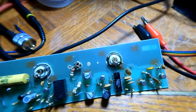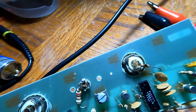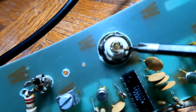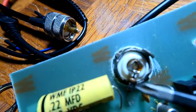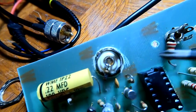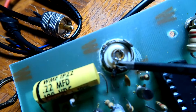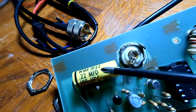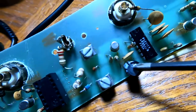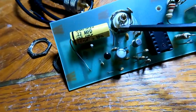I'm back and I've discovered what I believe might be the big problem. We've got some burned-out resistors coming into the frequency counter — this one is burned, this one is burned. Whatever happened here happened some time ago because I would have smelled it if it burned during my testing. The next step is to pull the schematic and find the power rating and resistance values of these resistors. I might also pull this capacitor off and test it.